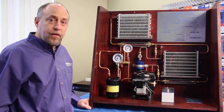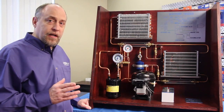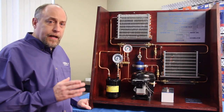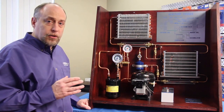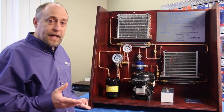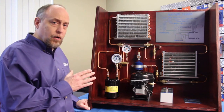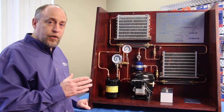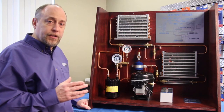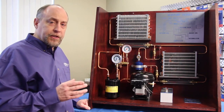So as you can see, the Imperial TU701 can be a great training unit for residential and light commercial service technicians. A couple of other key features are that it uses R134A as a refrigerant — environmentally friendly and very common — and it also uses a lot of off-the-shelf parts from your local supply house. So if you have to make a repair to this unit — condenser, fan, evaporator, fan, or maybe even a compressor — you don't have to come back to Imperial to get the parts. The TU701 can be used as a standalone unit to demonstrate the refrigeration and heat pump cycle, or you can use these as training modules and have several of them in a classroom allowing students to actually service the units, remove components, test components, recover or reclaim gas, or any other service procedures you might want to do.